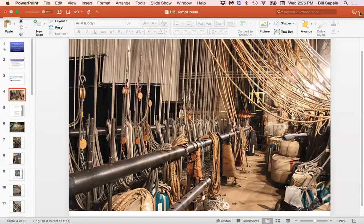So in front of the pin rail generally, and you can see a little bit of it on the upstage part of this picture, on the floor, you have this giant pile of hemp. In the old days, hemp, right? Manila hemp rope. And that rope, because it was a natural fiber, had a tendency to rot if it didn't get enough air flowing around it. And so most of the hemp houses had a wire mesh basket that was hung off the front of the fly loft into which you could coil neatly, or sometimes not so neatly, all of the excess rope you had on each of the line sets.